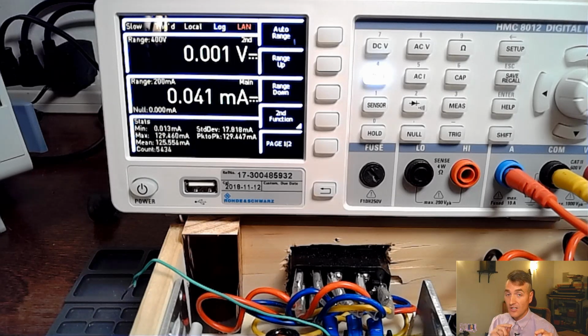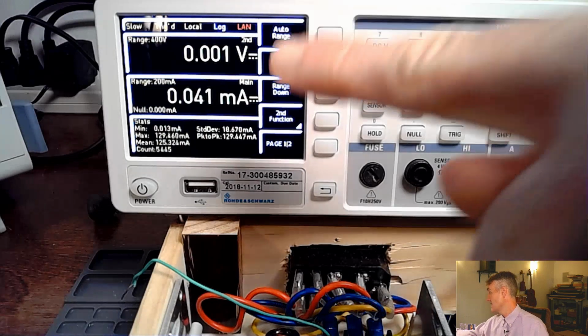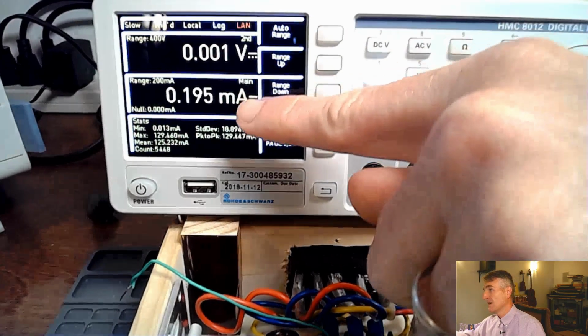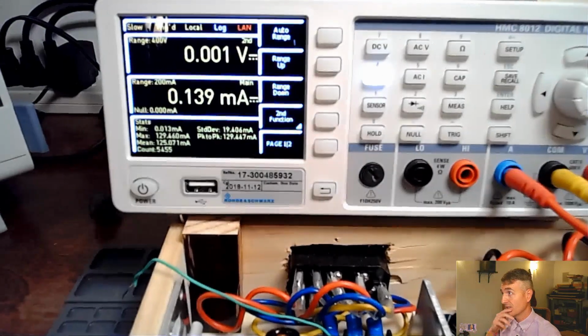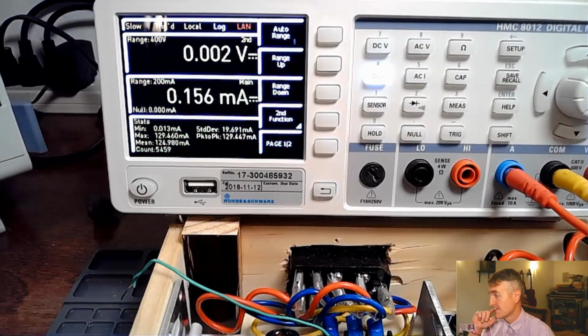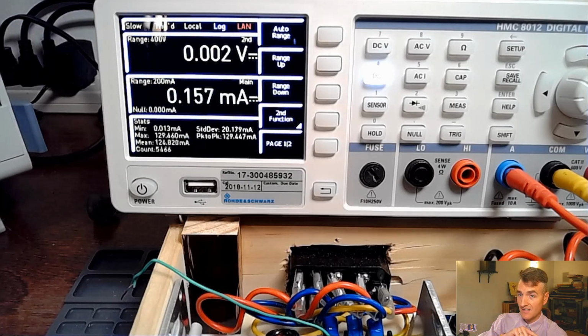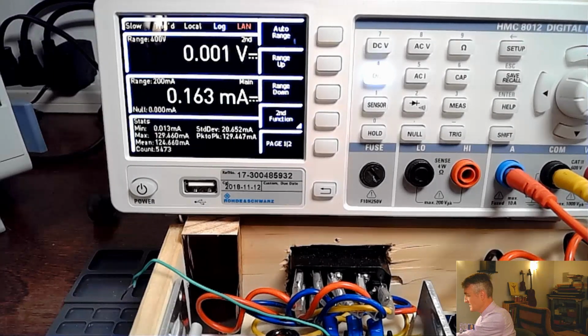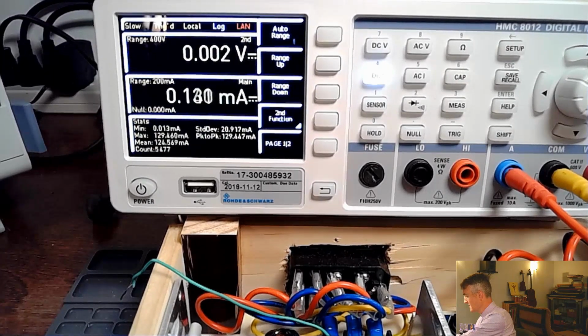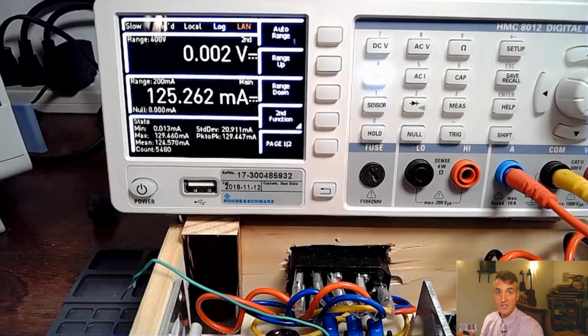And so at the low power state, you can see I'm actually burning less than a milliamp of current. So right here on my multimeter, you can see it's less than a milliamp. It's a couple of hundred microamps. Is that right? Milli, micro? That is right. As you go down in tens. Microamps. Now, if I energize my amplifier, so I'll energize it, and you can see, boom, hundreds of milliamps, which